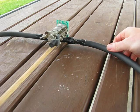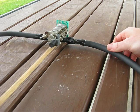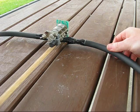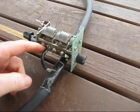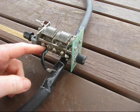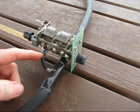You'll notice the loop is all black. How did I do it? Irrigation tubing is very useful, and you can easily get a 20m length that slips easily over 13mm copper tubing — it's a nice fit. The end of the tubing is just here, just under the gaffer tape, and from that I've got coax pigtails going to the tuning capacitor. Make them as short as possible. I used RG58, but strictly speaking the thicker the better, so if you've got RG213 braid, use that instead.